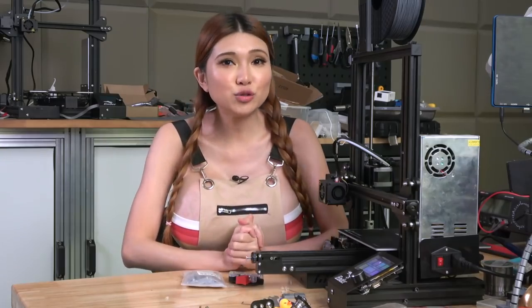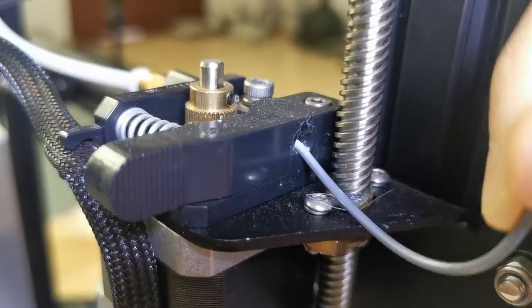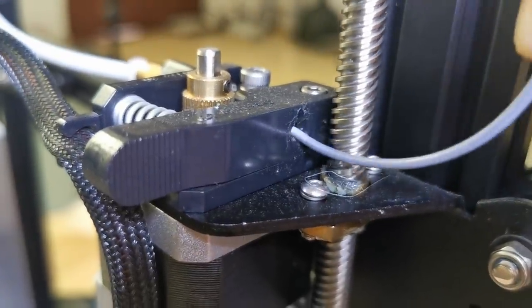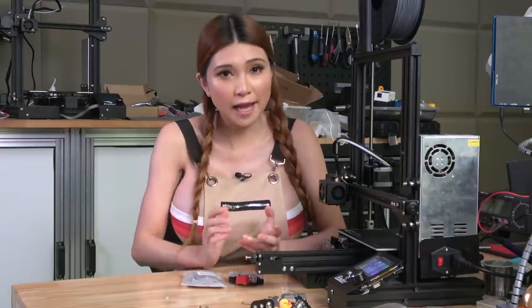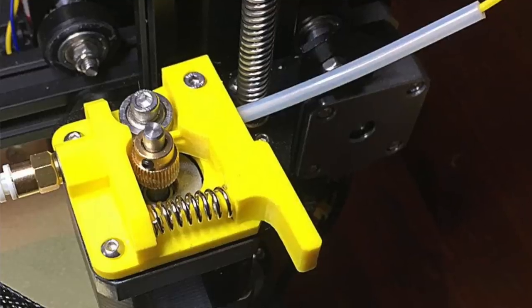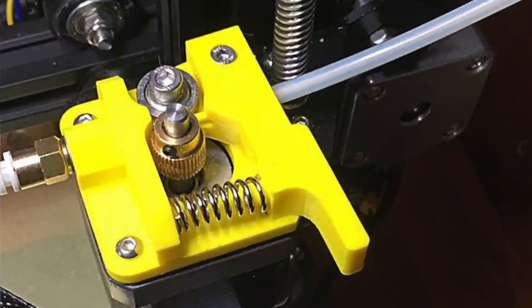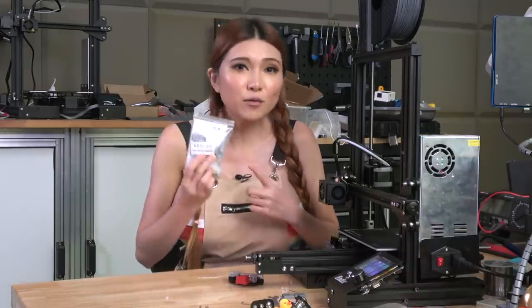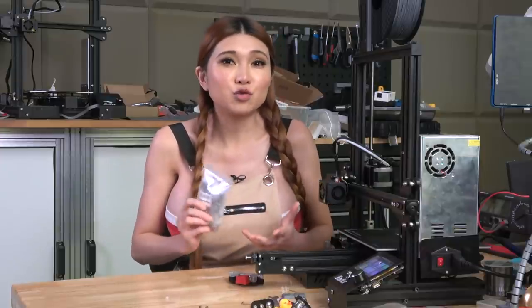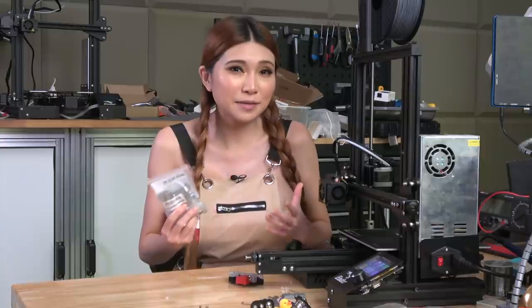One common issue with the Ender-3 is right over here on the extruder. See how the filament slowly cuts a notch there? It takes hundreds of hours, but it happens. This can be fixed cheaply by just printing a new plastic extruder once a year or so, putting in a bit of PTFE tubing as a bushing, or you can buy a metal one for about $10 to $25, depending on if you upgrade the Bowden tubing at the same time.